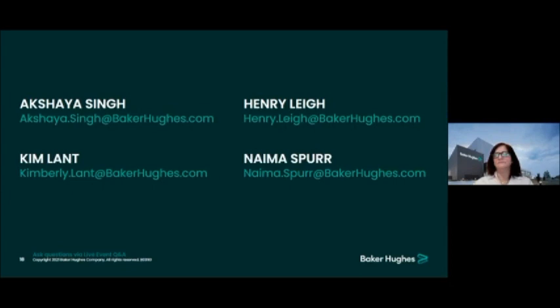Thank you for those questions, Naima. To address the first one, defining a success criteria for a water conformance product, like I mentioned in my presentation, is a little difficult, and you always have to be cautiously optimistic about what you define as a successful job. When it comes to sellable production, in the first field trial we saw that we doubled the oil production. That does not mean we created more oil. All it means is that we were able to impede the flow of water enough that more oil could come out in the same time frame. So that's always the intent.